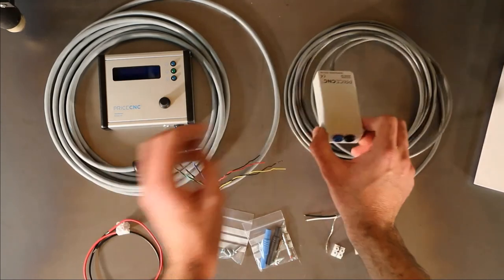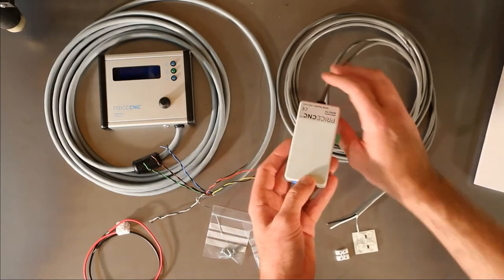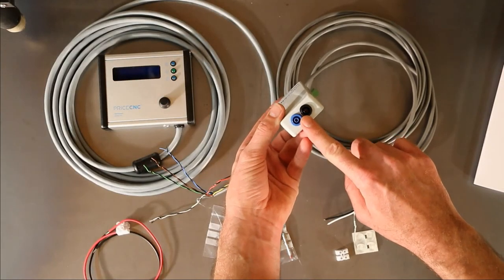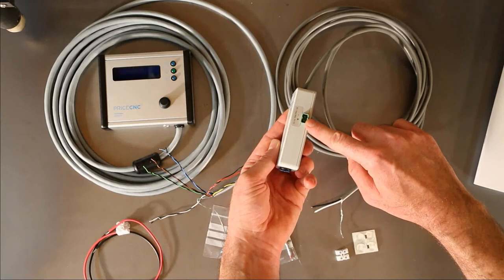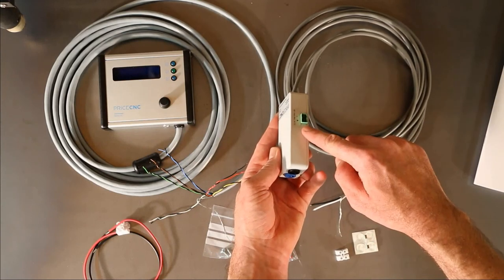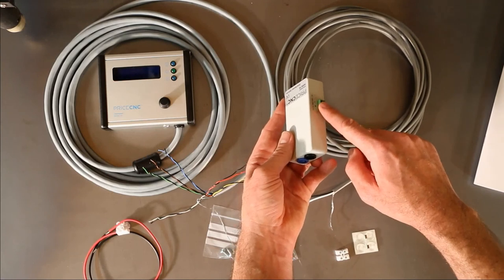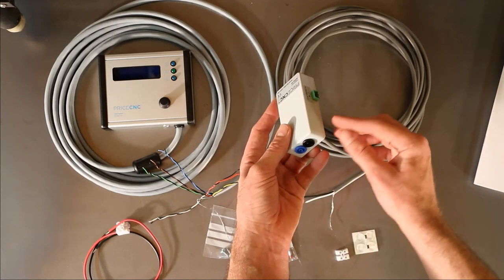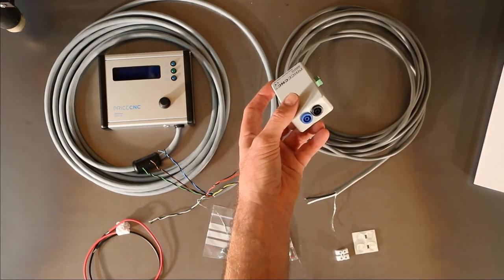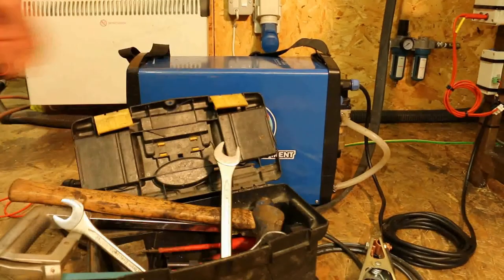This is the isolation module. It connects your plasma cutter to the height controller so that the height controller can measure the arc voltage. Ideally it should be located close to the plasma cutter. There are two 4mm sockets on one end and a small green socket on the side. The two 4mm sockets are for raw or direct arc voltage measurement, and the green socket is for 50 to 1 voltage divider measurement. You will only need to use the green socket or the other two, but not both. Most plasma cutters do not have a convenient connection point for measuring raw arc voltage, so generally some modification to the product is required.